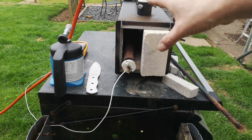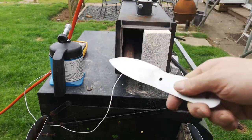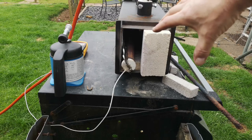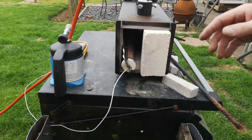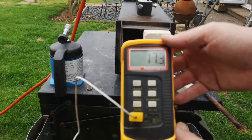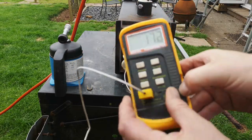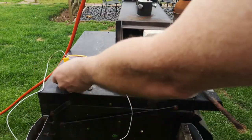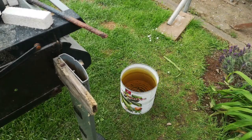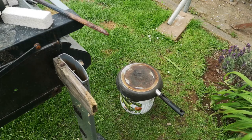By putting it in the tube and letting the forge heat up slowly, I get a better idea of the actual forge temperature. Once the forge temperature is up to range, I put the knife in out of the direct flame and let it heat up slowly to the desired temperature, which I monitor on the thermocouple. It's reading 17.3 degrees currently and it's dead accurate — I've checked it with boiling water and freezing cold. That's my oil over there, and the improvised lid is in case of any flashing.